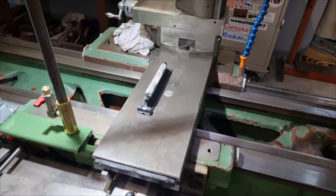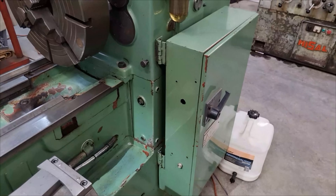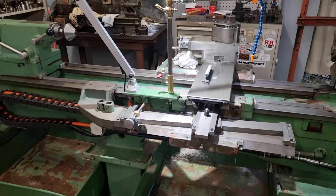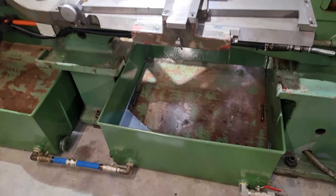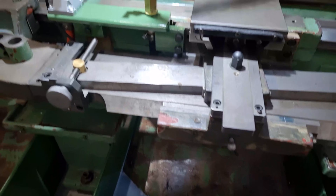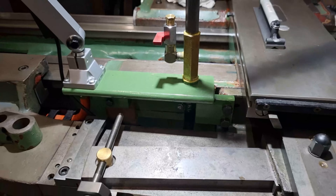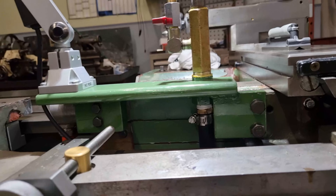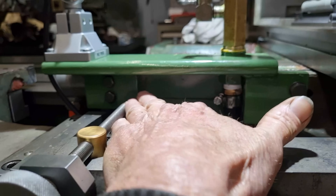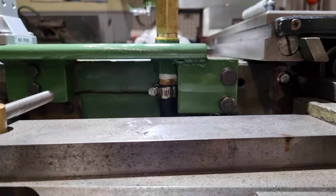It's looking like we do have to make an adjustment on the feet up the headstock end. While we're over this side of the lathe, we've got our coolant in now. And that bracket I was talking about last week — I've fabricated it up. That's all out of 16mm plate, about 25mm under there. This is a good solid bracket.